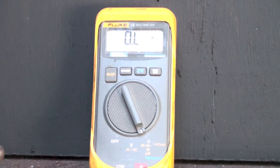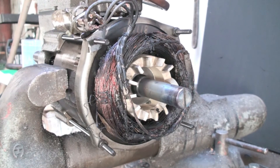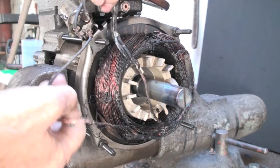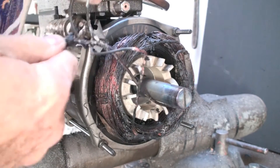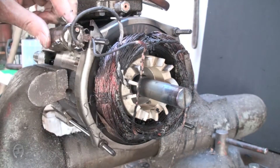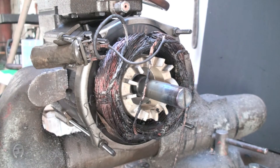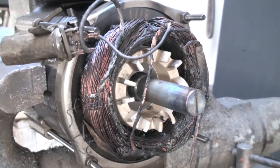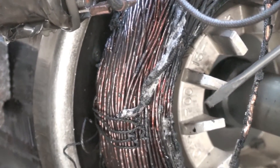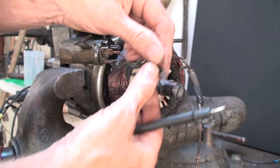So the common circuit has failed here someplace. Now here's the internal overload, and the wires are coming off the internal overload here — that one there is still intact. This one is not intact. I get the funny feeling the windings in this aren't burned out yet; it's just these wires going to the internal overload. I'll give you a close-up there where these wires go in — it appears it's right in there. The only wire that's actually open is this one here.